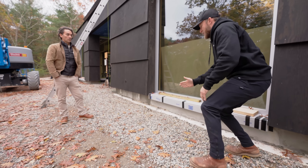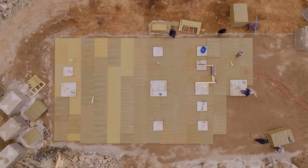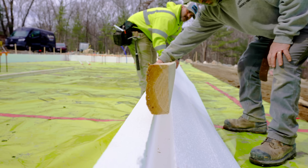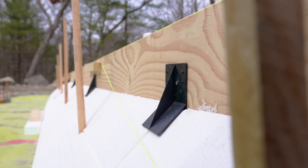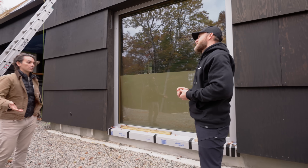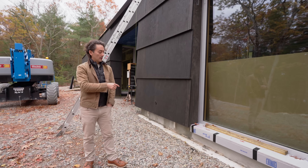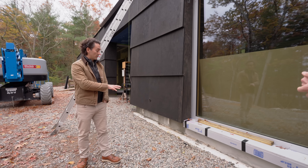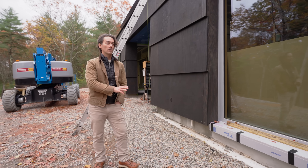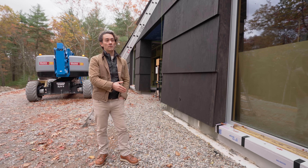When we talk raft slab, we essentially framed the entire footprint of the home with foam blocks, and those foam blocks were triangular in shape. The insulation extends about four feet out. What we're referring to is the monoslab formwork — a really fascinating commercial product for achieving a frost protected slab on grade. You typically see it in agricultural and commercial buildings, especially in northern states and Canada. What's novel is they're using the insulation as the concrete formwork.